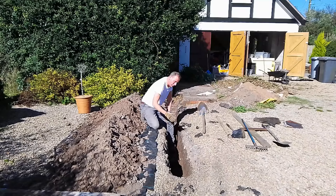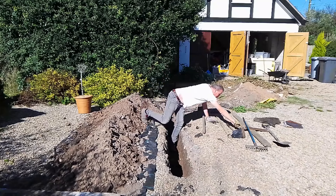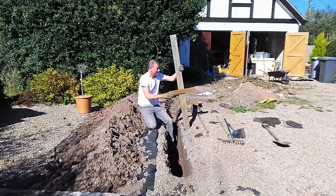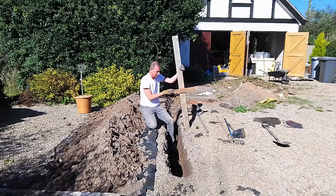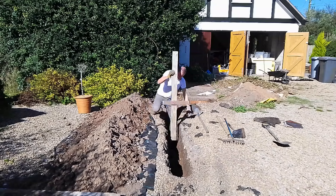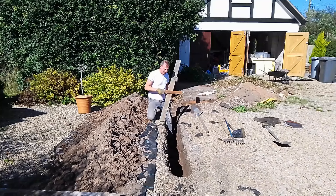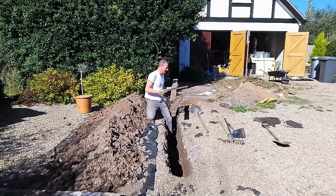The electric cable has to be two feet deep, so one of the first things I've done is made a little guide. It's a piece of wood — a horizontal plank — and that is two foot deep. You can see it's not deep enough yet here, whereas if I move it over here we're getting there. A simple thing like that makes it so much easier to know when you've got to your two foot, and it's always to hand.